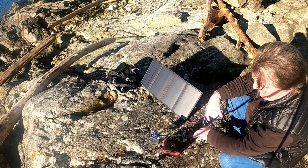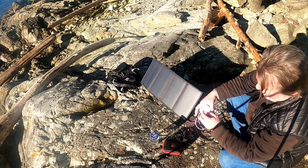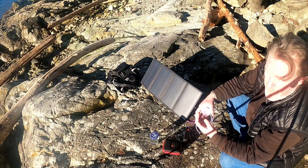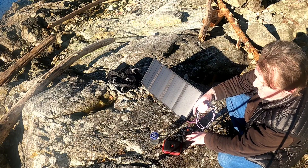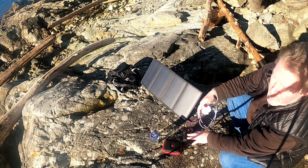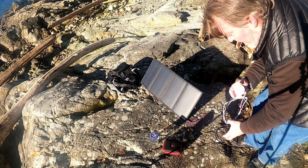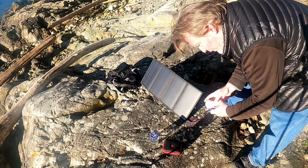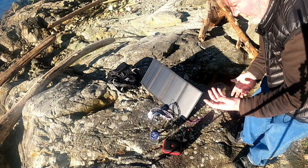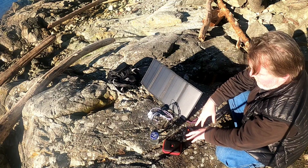So in reality, at 5 volts, you're getting closer to about 15 ampere hours. These lights run at about 1 ampere hour at 5 volts, to give you an idea, for the 5 watt lighting. So I could run one of these lights for 15 hours non-stop, from dead to full, off of this battery before I charge. And normally I'm only running lights for 4 or 5 hours a night. So over 3 days, at 5 hours, that's 15. That's right up to the capacity of roughly what I'm going to get out of this.